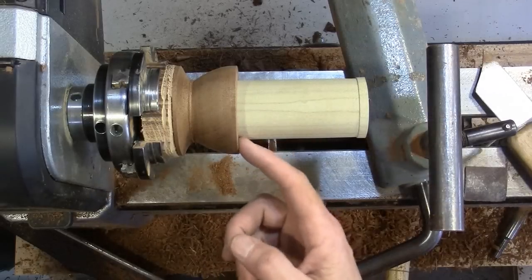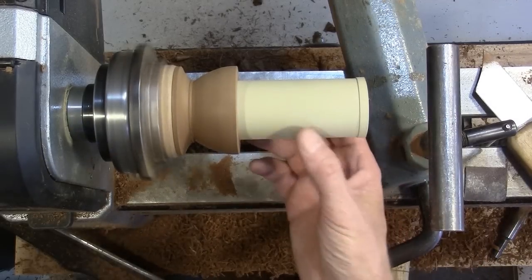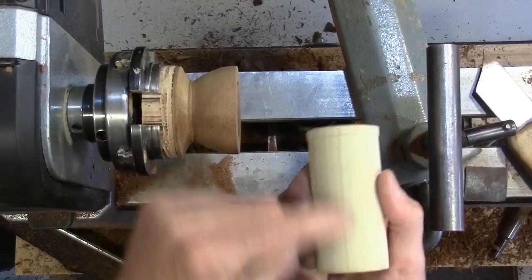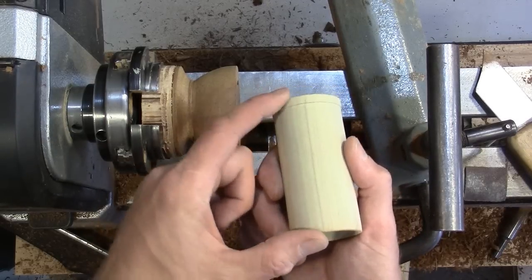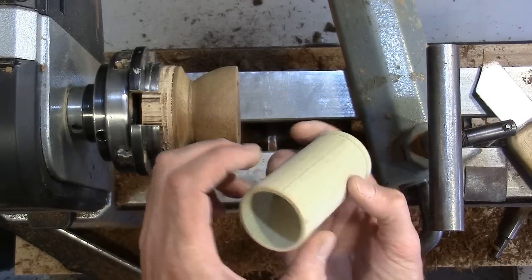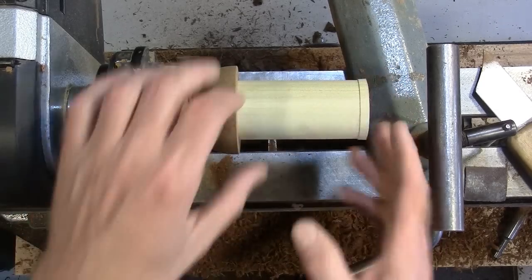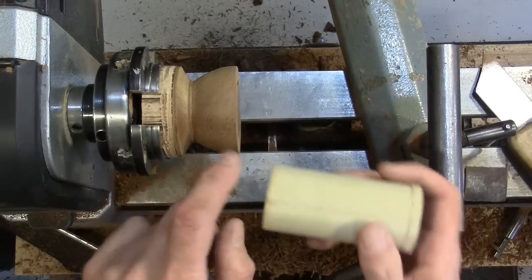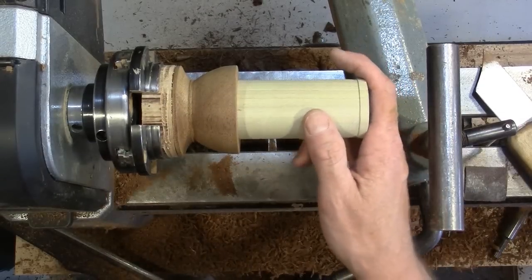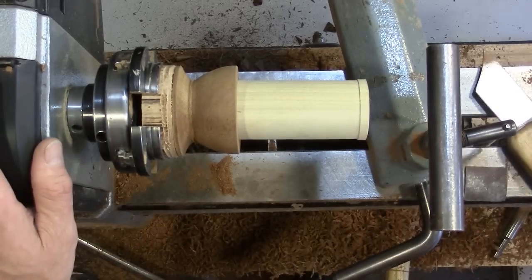Okay, so once you get the groove in there and it seats down in there, runs nice and true, you can make your slice. But don't do the slice down the center for the pins first, because once you do that, it's going to close a little bit, and then when you do this, it's not going to be even. It's going to be off a little bit. So do this first. Put your groove in there, and that way it'll expand back open when you put it in and glue it in.